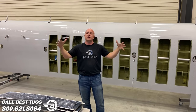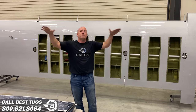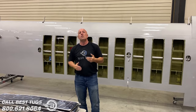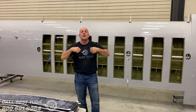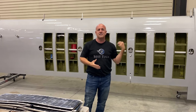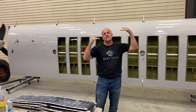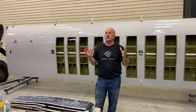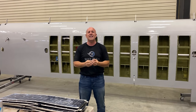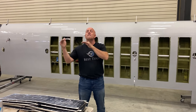If the flaps were fully deployed, the ailerons were drooping, it would lock in that position, both sides the same, and you could fly indefinitely safe, just not as fast. Or if it locked in fully retracted position, then you would just land a little faster. Now with the size of the wings we have, even with the flaps at zero, the leading edge device tucked into high speed mode, this will still land extremely slow. So there's no configuration in any type of a failure that would cause an asymmetric flap or an unflyable event.